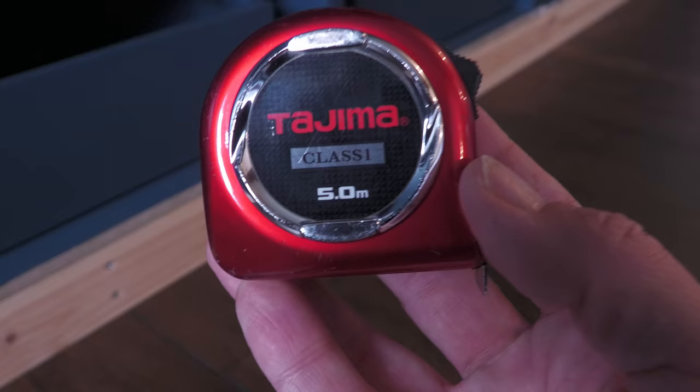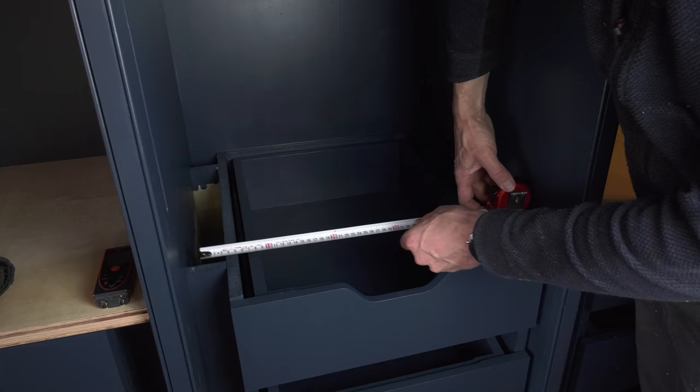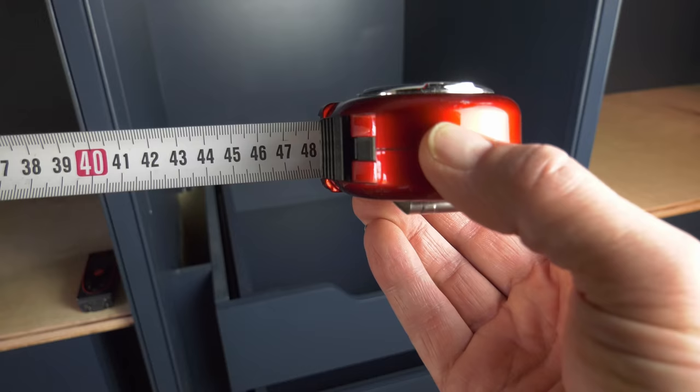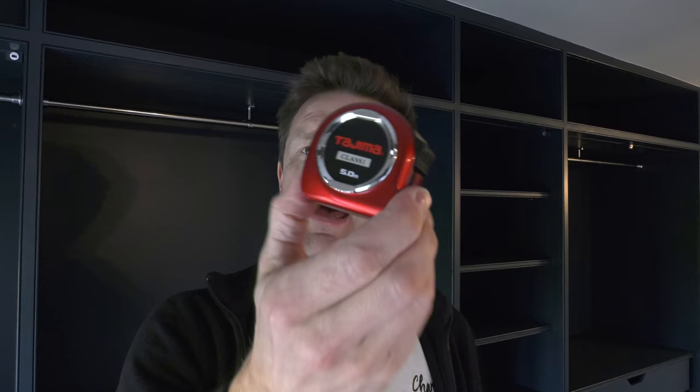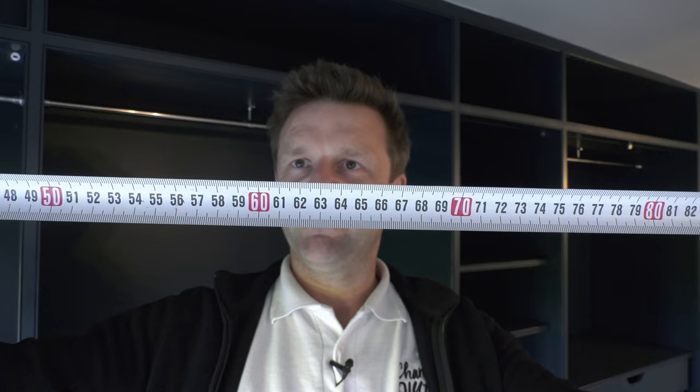So I thought I'd start today's video with a quick tip - which probably loads of you know already - to avoid this happening on your wardrobe builds, and thanks goes out to my carpenter mate John for reminding me about this. If you buy a half decent tape measure like this, it comes with its width printed on the back, so you can simply measure your space and then add that length to the reading on your tape for a pretty accurate total width. It's worth pointing out that my Fatmax doesn't give you this option. This Gima, which one of you guys kindly recommended, has been my preferred tape measure for all precise measurements on this job.